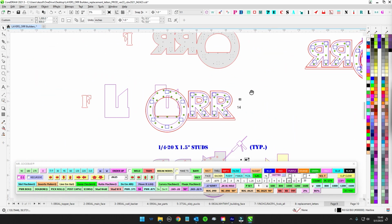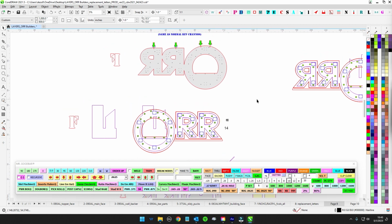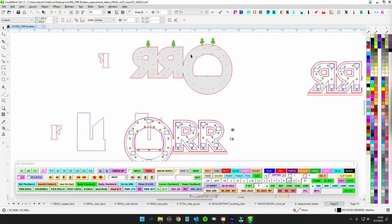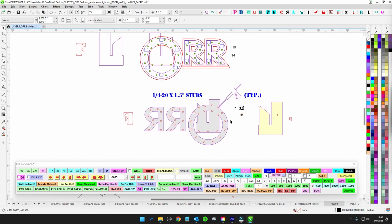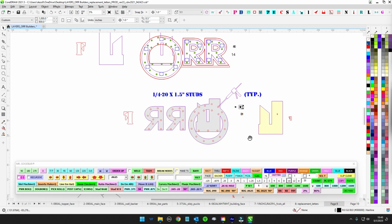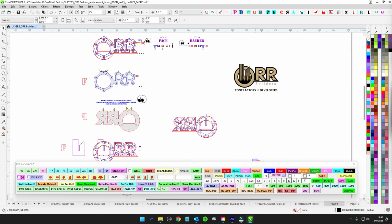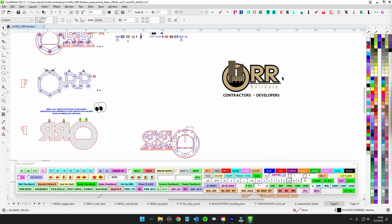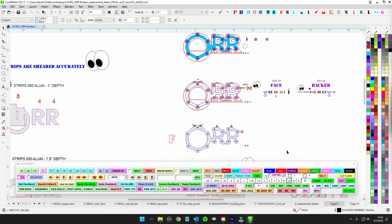So like I said, I really encourage you to do a pre-fit on all this before it goes out to paint. Make sure I didn't mess up, make sure there's no issues with holes and fitment. Go ahead and deconflict anything early before paint. We don't want to be grinding on this or scratching it after paint. Like I say, the customer's kind of discerning, wants it to look really, really good. So just take our time, slow is smooth, smooth is fast.